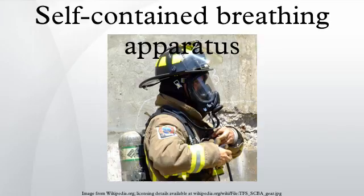In practice this usually means that the SCBA must comply with the European Standard EN 137-2006. This includes detailed requirements for the performance of the SCBA, the marking required, and the information to be provided to the user. Two classes of SCBA are recognized: Type 1 for industrial use and Type 2 for firefighting. Any SCBA conforming to this standard will have been verified to reliably operate and protect the user from −30°C to +60°C under a wide range of severe simulated operational conditions. The Royal Australian Navy uses the Open Circuit Compressed Air Breathing Apparatus, a backpack-style positive pressure breathing apparatus, for firefighting roles.